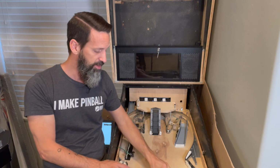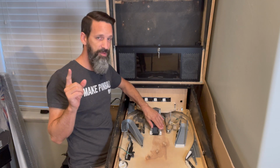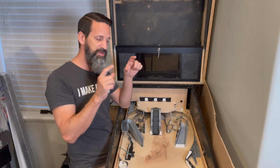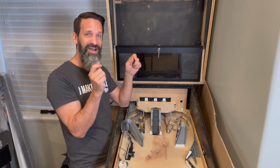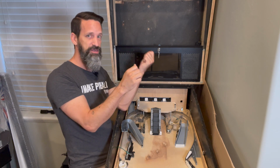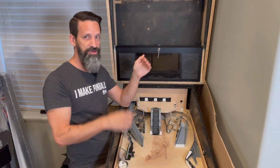Now, I should warn you, the default MPF stepper code only handles it going to absolute positions. By that I mean with the stepper motor, if you played around in the Control Center that Pololu Tic has, you'll notice you can start at 0. You can either go negative or positive numbers. And so I can either go to 50 or negative 50.